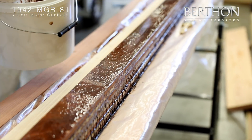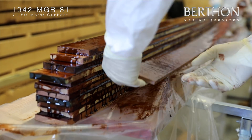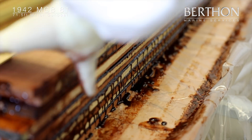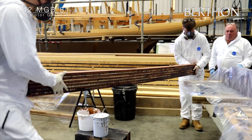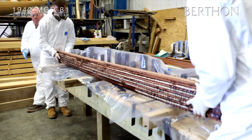Here you will see a couple of Bertha's apprentices gluing up individual planks before laminating to create the shape of the new hull frames. Each new frame is made up of 12 planks made from a flexible light ash and a heavier stronger mahogany. These are glued together to make a strong and flexible frame.